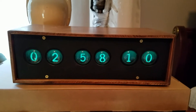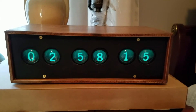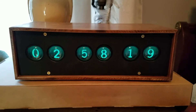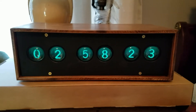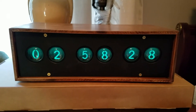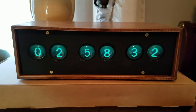The E1T is a beam deflection, whereas the NEMO tubes are an actual little CRT with a mask in the shape of a digit. The electron beam is deflected through the mask, so it can display up to 10 digits.